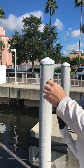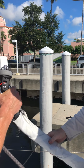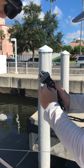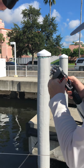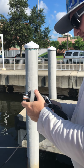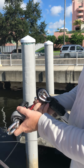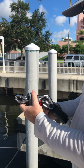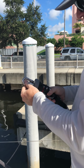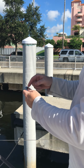Okay. So your spinnaker halyards. This thing again, we have the little, what is the rip? Okay, if you have to get the swivel off, this pulls this pin, and it's a little tough. Right. But it really doesn't come off much. And that releases that. Again, just keep it on there. There's really no reason to. But if you have to take it off, that's how you do it. And then that snaps, it locks it right back. Okay. So what we'll do next is we'll attach the halyard to the top.